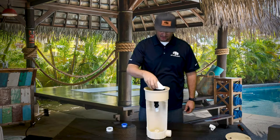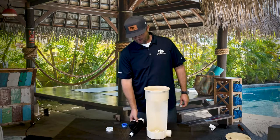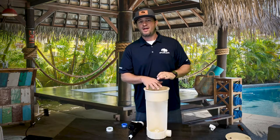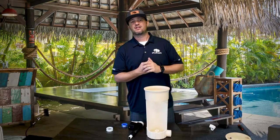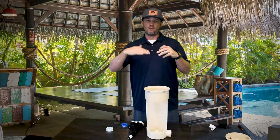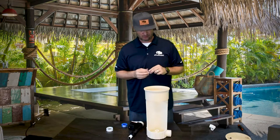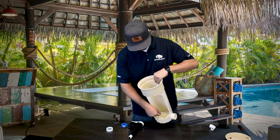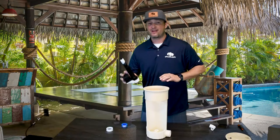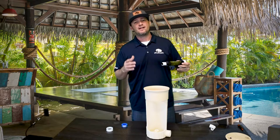You can go to any department store and buy these water levelers, but when you buy them with the A&A manufacturing package, you get the restrictor seal. The restrictor seal makes this thing a lot quieter, and at your house where the vacuum breaker is, there's no water hammering against the side of your house. These style floats allow a good amount of water then turn off rapidly — boom, boom, boom — so you don't want that against your house. If you restrict the water flow, it allows a little bit at a time, which prevents hammering. The restrictor sits in the hole in the bottom. We always recommend using the restrictor flow — you don't need mass amounts of water going into your pool unless you've got a hotel-size pool, and that's why they have a couple of water levelers.